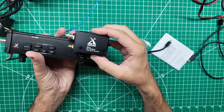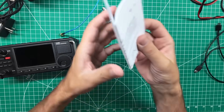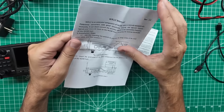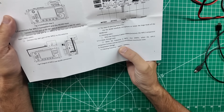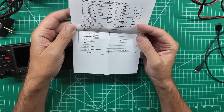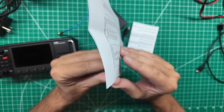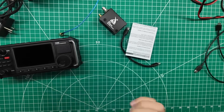What they did with this is they want you to bolt it on up top like this, so two bolts replace those two screws. I need to check first to see if this needs a certain version of firmware or not. If you get this thing from my friends over at Radiodity, they take excellent care of their customers. Working frequency expansion from 54 megahertz to 1 gigahertz. You'll see the WR12 logo — I'll show you how to get it connected. It does not say it needs any new firmware, but we will know right away if we don't see the WR12 logo on screen. If not, we'll do a firmware upgrade because I know how to do that.